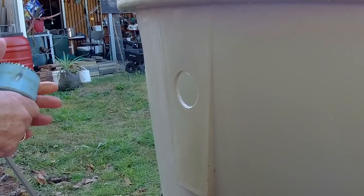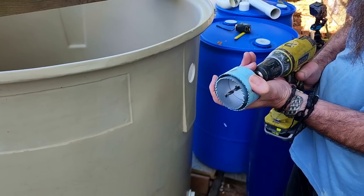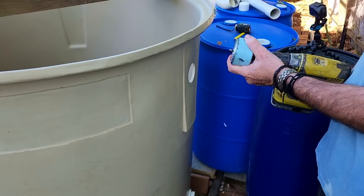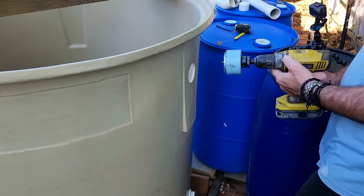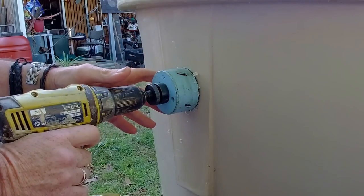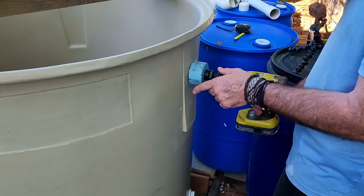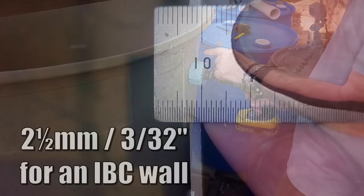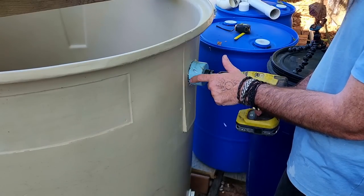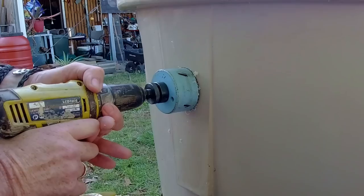One more check of the camera settings and I'm going to drill a hole. I haven't used this method myself before with this style of hole saw, so it'll be interesting to see how it goes. Because of the thickness of this wall being over six mil - quarter of an inch - I can run this blade forward the whole way through. With an IBC, I'd start the pilot hole off first and then run the saw backwards, otherwise it's going to grab your plastic and rip it. So here we go.